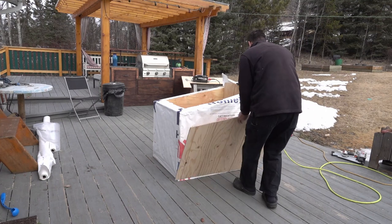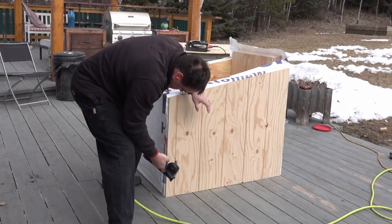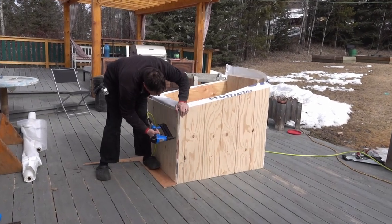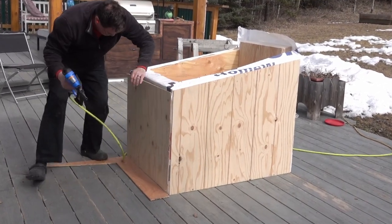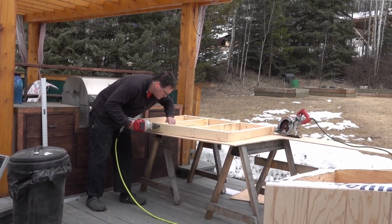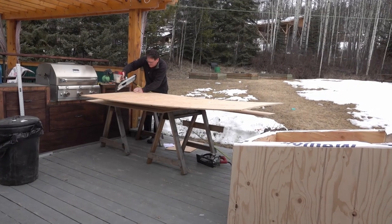Finally got to the exterior sheeting. I used 3/8 inch ranch wall paneling, which gives a nice board-like finish. It is inexpensive at under $30 for a 4x8 sheet. I used 1 inch staples to attach the pre-cut panels. I designed the roof to have an overhang for weather protection.